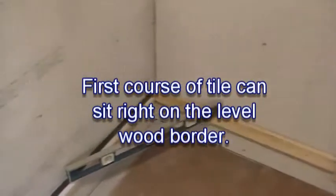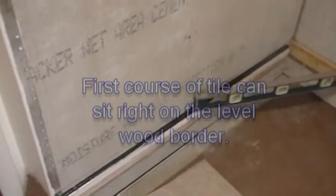Today we're preparing to put the tiles up on the wall. I've measured down from the top to where I want to start and screwed a border around here with some scrap wood — make sure it's nice and level. This way you can start your first row sitting right on top of that wood and you're assured that it's going to be level. Then you work your way up the wall from there, come back later, unscrew those supports, and cut in your final pieces along the bottom row — a technique I learned in building trades in high school. I've also put a bead of silicone rubber in the corners to assure some waterproofing, and I'm going to tape the joints with the special tape for the hardy backer.